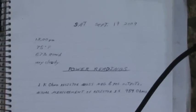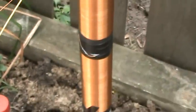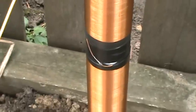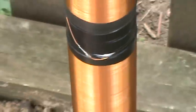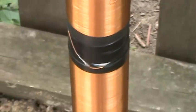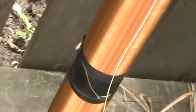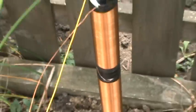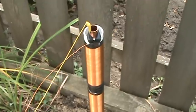The resistor actually checks 984 ohms, so we're going to use that exact number. I got rid of the little red clip joining the two coils together and made a nice solder joint there. Plus I squared up the coils more. I put a small cardboard spacer in between the coils, keeping them square and compensating for the crookedness of the ends, putting the coils nice and straight.